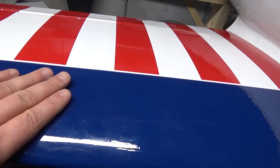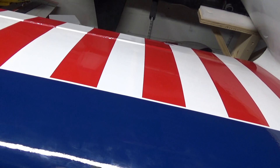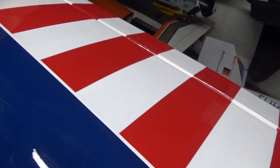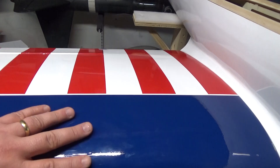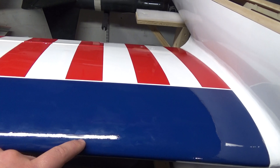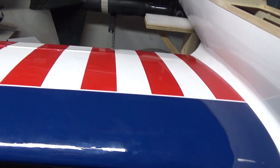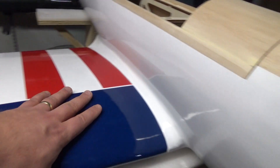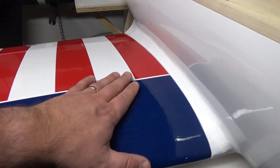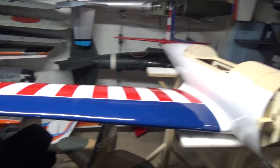Because I sealed this wood it is so easy for air to get trapped under there. I have a real dry basement in the winter time so I just let it wrinkle up for a while. I put it down with a lot of heat and a lot of pressure but I'm going to let it wrinkle up. For these couple little spots where there are some bubbles, I have a small hypodermic needle to just poke a couple holes, hit it with the iron, and they'll work themselves out — no big deal. It's a pretty smooth finish for an amateur like me.